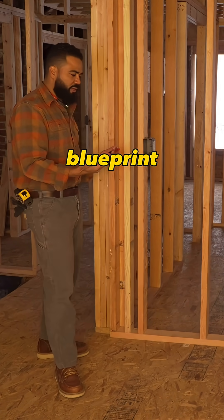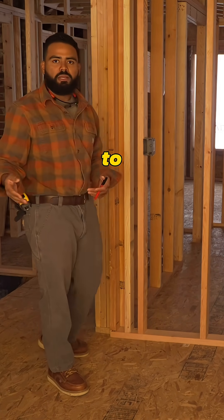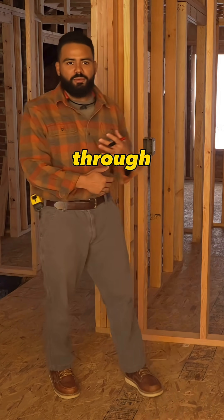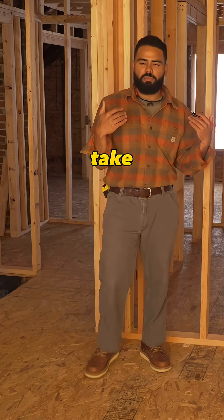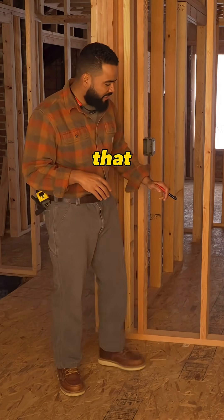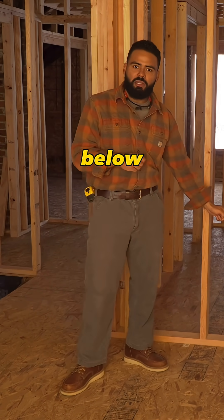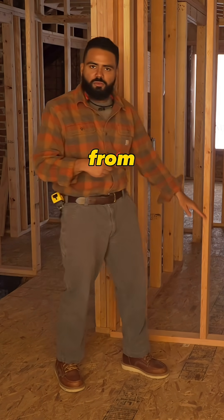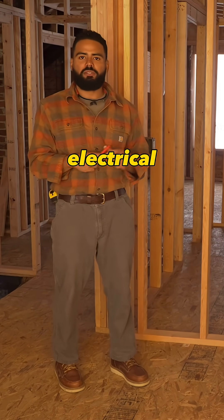When you're looking at a blueprint and going to lay out the room, to be an electrician you need to know what these symbols are. When you start going through these symbols, it gives you a visual of what's going to take place. We're using the same box down below as a switch box, so how are you going to differentiate one box from the other? That's where these electrical symbols come in.